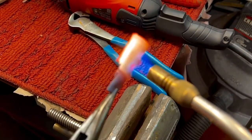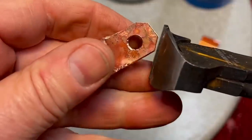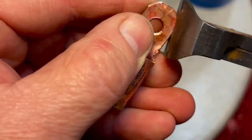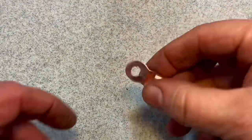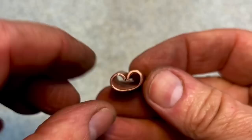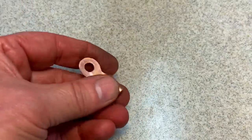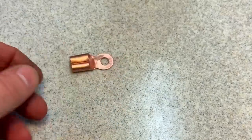For small copper like this, you only need a propane torch and it will become cherry red. Now that the copper is nice and soft, you can use your nippers like this and create your shape — see how easy it cuts through there. When copper is in its soft state, you can form it to whatever shape you want. You see how nice and easy that cuts using nippers. So there we go — in only about 15 minutes we made ourselves a nice little clip here. I pre-bent it so that when you put the wire in there, it already crimps in nice, and you can throw some solder on whatever you want. You can always make things in your shop, and that's what's so great about having metals like tubing around — you can always make something like that.